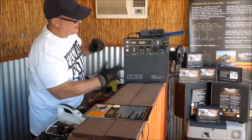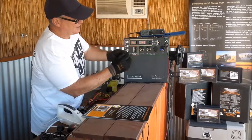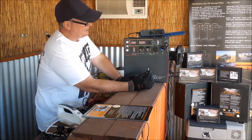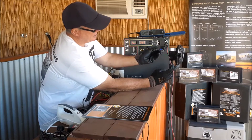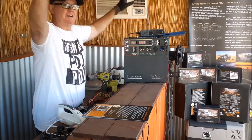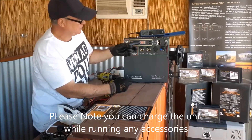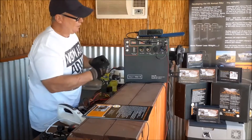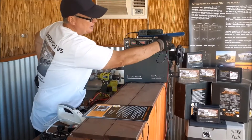The two cigarette sockets and the Anderson are all 10 amp outputs. The dual USB ports are 2.5 amp and 1 amp outputs — I'm charging my satellite phone at the moment. On the end here you've got two 2.1mm jacks, available from pretty much any electrical store. You can connect a red and black cable into here — I've got 14 lights running across this sea container all running off one of these jacks, only pulling 1.47 amps including the satellite phone charging.